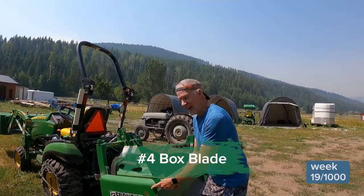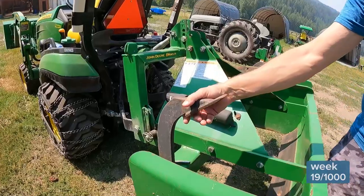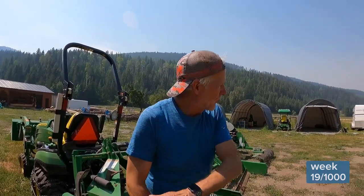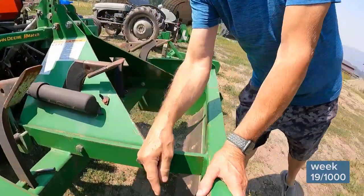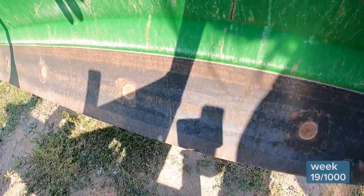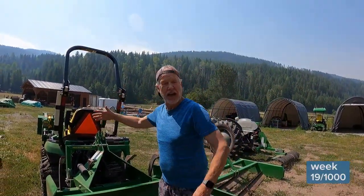Number four: the box blade. This is a force to be reckoned with when it comes to moving earth. I intentionally left the tines in their upright position — the deal is you flip the tine, pop it up from the bottom. There are two adjustments: one gives you about three inches of dig, the other about six inches. It loosens the earth. You can move the loosened earth with the front bucket or with the box blade itself. Looking down inside, there's a great cutting edge — but bonus, there's a cutting edge on the other side too. So I've got a pull-push arrangement where I can pull half the earth forward and half backwards, then scoop up the windrows with the front bucket.